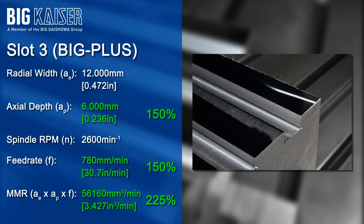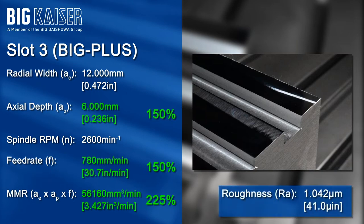For the third slot, which used the same Big Plus holder, but with 50% greater depth of cut and 50% faster feed rate, the finish is still superior to slot 1. An RA of about 1 micron was measured on the wall surface of this slot. Because of the Big Plus tool holder's greater rigidity, the MRR for this slot was able to be increased to 225%